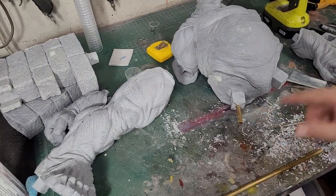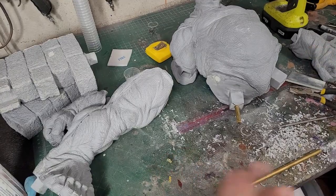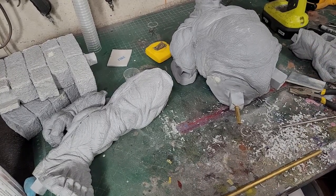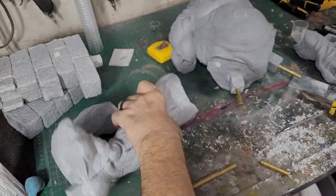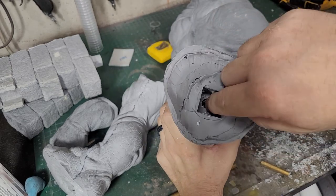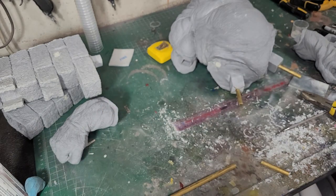Okay, so while this is drying, I'm going ahead and drilling out the hole on the other side and getting the key cut and inserted. Might as well do that while it's drying, and that way I can work at these legs at the same time. While that epoxy's drying, I glued the other pin. And what I'm doing is going in here on the legs with the 5/16 inch drill bit, and I'm kind of wallowing it out, so I got some play for those keys.